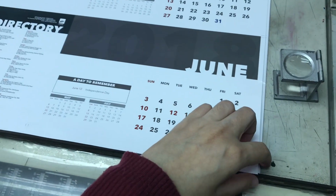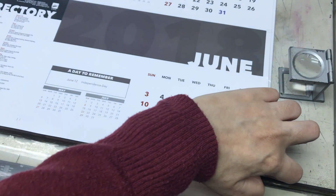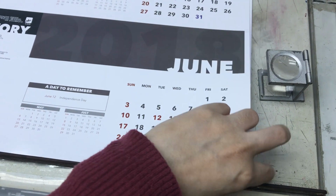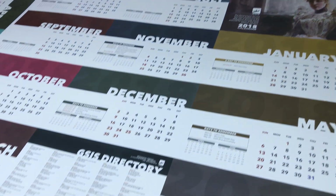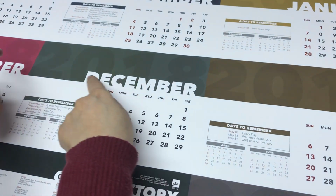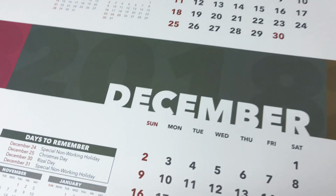And then we also looked at all of the portions on the printout and compared them to the other sheets that came before, because the thing with offset is that sometimes you need to run the machine a little longer and print on a bunch of sheets before the ink can actually adjust into more consistent levels, like this one we're pointing out in the December 2018.